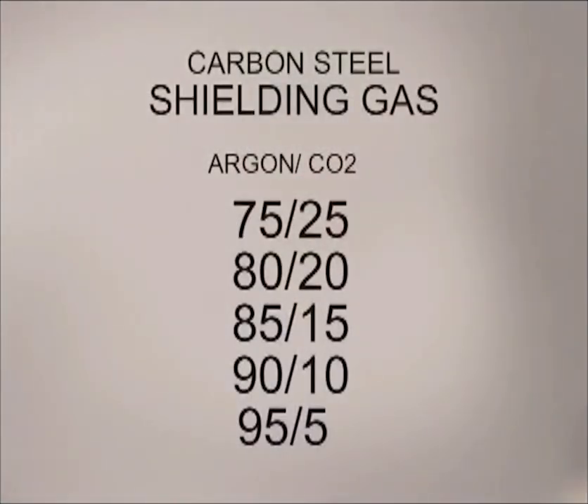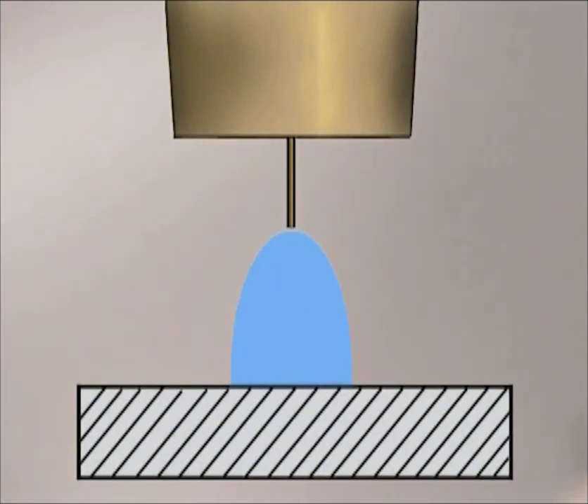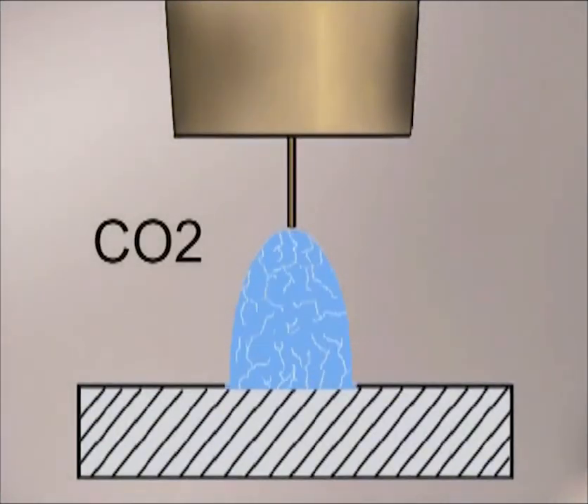The shielding gas used for welding on carbon steel is generally a blend of carbon dioxide and argon. The main job of this shielding gas is to cover the molten weld and keep it from coming in contact with oxygen and nitrogen in the surrounding air. But these gases also affect the characteristics of the arc itself. The arc creates a stream of hot, electrically charged gases. Straight carbon dioxide does not transfer current well and requires a higher voltage. A wide arc stream is formed with a lot of energy that breaks up surface oxide and allows good penetration and weld fusion.